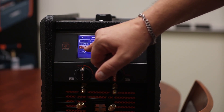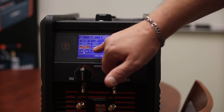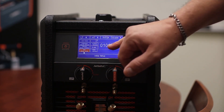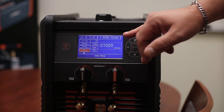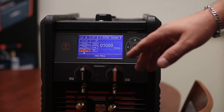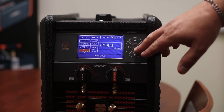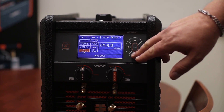Now that we've calibrated our sensor, we can set our vacuum decay. How long do we want to do our decay test? Five minutes or ten minutes — I've got it set up for five minutes. How high of a decay do we want to allow? I've got it set at a thousand. Target was 250, so this will allow it to go to 1,250 within that five-minute period, or fail. This is fully adjustable — you can take it down to one micron or up to 99,000 microns. You set it for your job, whatever your parameters are — POE oil, mineral oil, etc. You're the technician; you decide.